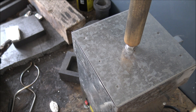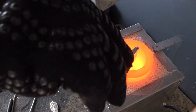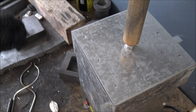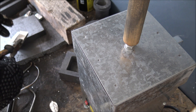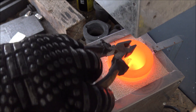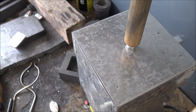The silver has melted in the furnace and now we're going to add the extra pieces that didn't fit in the first place. You can just simply drop them in and they will melt down relatively quickly because they're nice big chunky pieces of silver. Silver being such a great conductor, it really does happen quite quickly. I don't think we're going to fit the third one in just now because when you put the silver in, the entire temperature of the unit goes down and it's just solidified a little bit. So I'm going to wait a few more minutes to put the last piece in and then we are ready to pour the big kilo bar.